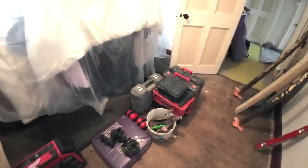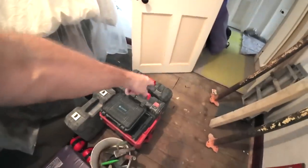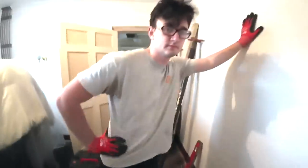Alex has brought all the gear up. A ridiculous amount of stuff, but I've got laser level, multi-tool for the skirting board, hoover for when we stitch drilling, and our levels. So first job is knock a bit of plaster off, find the course above our lintel, and get the strong boys in. So, let's do it. So the strong boys are going in from that side?